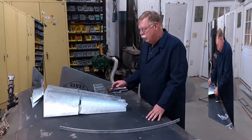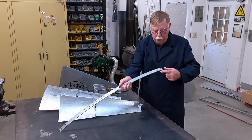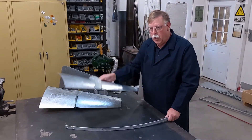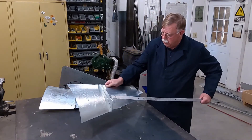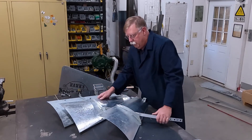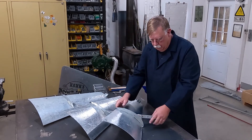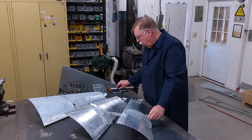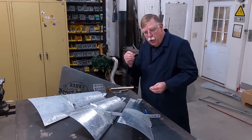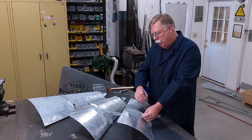Now we have our sail ribs on. We're going to take the outside wheel band — remember that X we put on — with the shortest distance between the bolt holes and the wheel arms in our left hand, curve facing this way, and just slip it right through. We'll do that three more times for all three, then move each one to the first two small holes. If you have a problem lining things up, slip your drift in there. Then take one bolt and a nyloc nut and bolt it on. Repeat that process for all three sails.